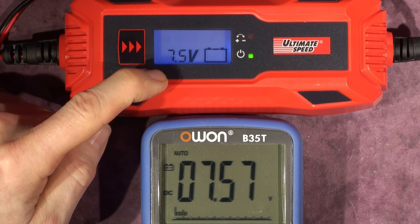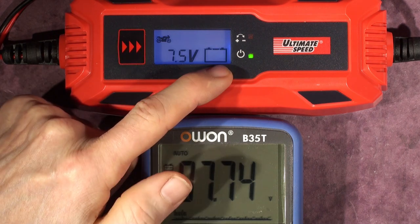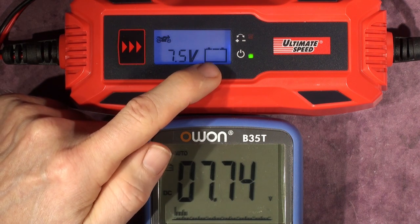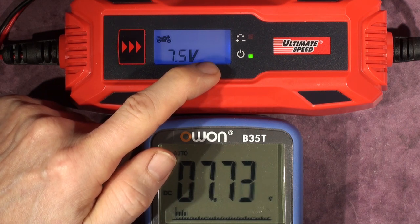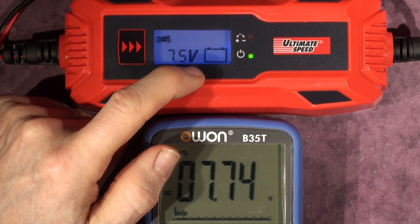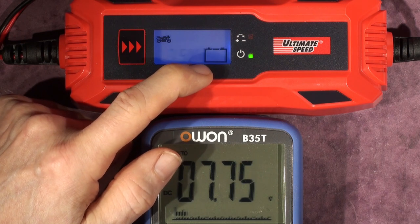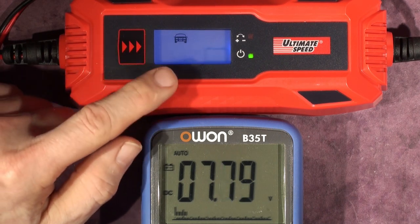It's still flashing — we've got the battery icon flashing at 7.5 V, confirming regeneration mode. On the current meter we have 7.7 V and 0.8 amps of charging current pulsing on for about 300–500 milliseconds, then off for 300 ms, then back on. The pulsing is much faster than the Aldi battery charger, though since it's on 50% of the time, the effective charge rate is the same.